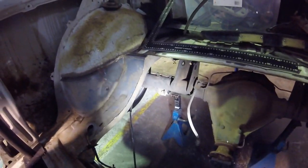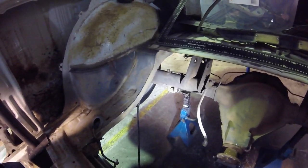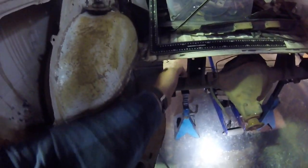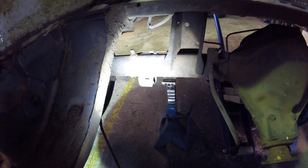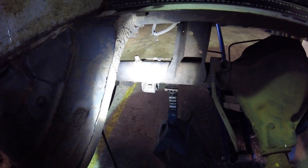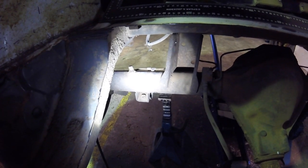Specifically in the rally escorts, they're right on top of each other. So I contemplated running them in right here, right where the chassis rail is. Contemplated going there, and of course that's smack bang where the sway bar mount is on the R31 diff. So I don't really want to start hashing around making different sway bar setups. I would like to just stick with as much factory as possible.